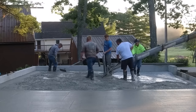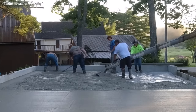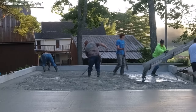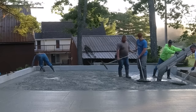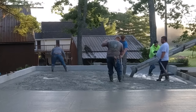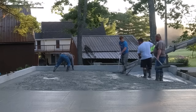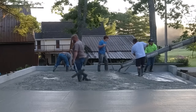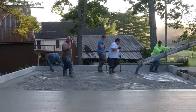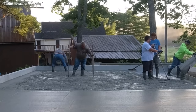You've got a certain amount of time to unload the concrete when you're pouring. Most concrete companies will give you seven or eight minutes per yard of concrete, so if you've got 10 yards on a truck, you get a little over an hour to get it down. For us, we're going to dump a truck out in about four or five minutes for probably around seven yards of concrete. It doesn't take a lot of time if you know what you're doing, if you have a plan and a process. That's a lot of the reason I put these videos out — to give you guys an idea of what guys do that do this every day.